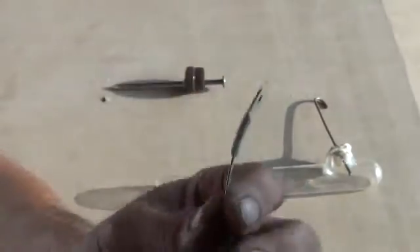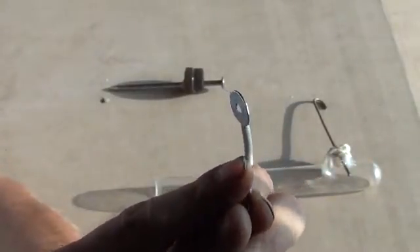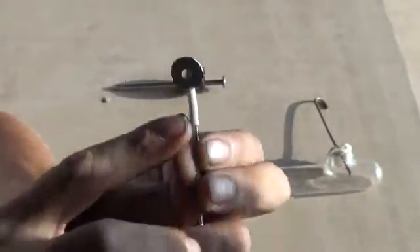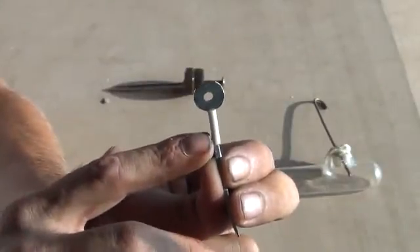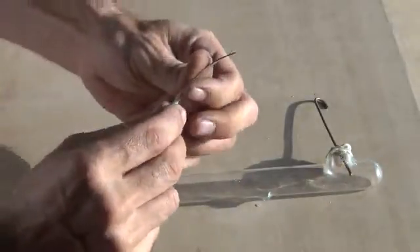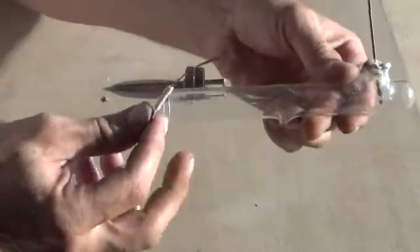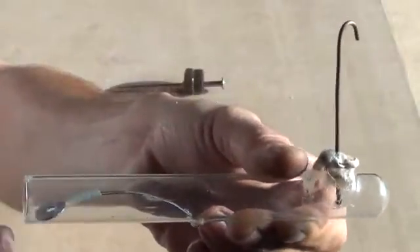This little white piece that you see right here is actually an insulator chunk from a piece of copper wire. I stripped the insulator off some wire and slid that from this side up over that. What that'll do is create an insulator between this and our glass, which is pretty necessary to make sure this all works. We're going to take this — you'll notice I've got a little bit of a bend and an arc to it — and hopefully maintain the same bend I've already preset, which will allow us to slide that into the anode ray tube.